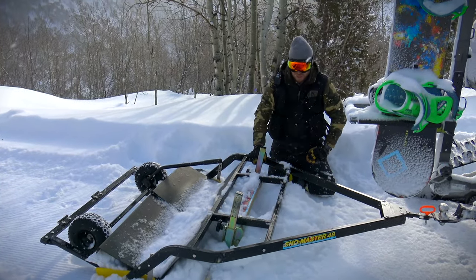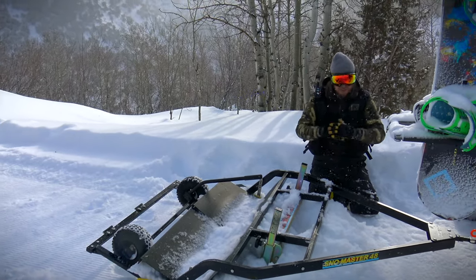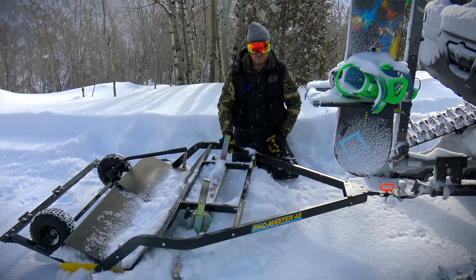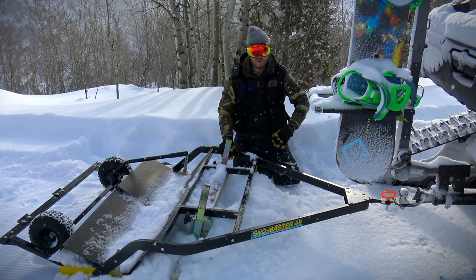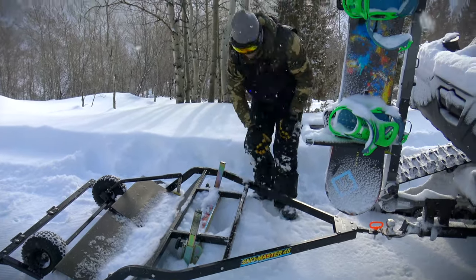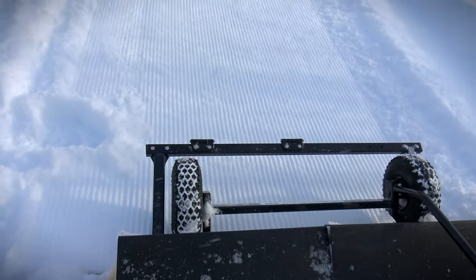Some tips and tricks while you're grooming: when it's nice fresh snow, you obviously don't need to use the snow razor if it's deep enough. Sometimes when it's only an inch or two, I'll use the snow razor to cut down into the snow to get a little bit of fresh snow and really get a nice corduroy out the back. Right now it looks like we have enough snow that I don't have to use the razor unless I find some bumps or ruts to fill in. Another tip is to groom right before it gets dark — the snow's a little bit warmer, you can lay down a nice corduroy and then it sets up and freezes at night so you can walk on it. This has all been groomed here at the cabin, but if you step off, you sink in. It's really nice to pack and compress your snow to ski on and have a lot of fun.